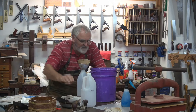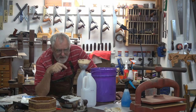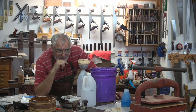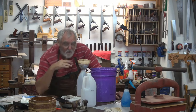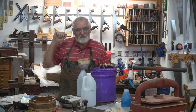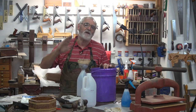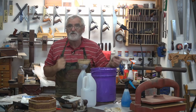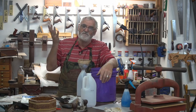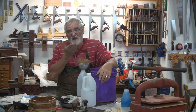Yeah, look, that's the idea. Who asked me about the debarker? Yeah, you have to be reasonably careful sanding it back. What I would suggest, and I do this on jobs, in fact, we'll do it on the picture frame tomorrow, is wet timber down maybe up to 6 times. Really give it a good larrup of water and then sand the grain off, do it again, sand the grain off, do it again. Eventually you'll wet it and there won't be any grain rising at all. There shouldn't be too much grain rising on that picture frame, because that was done with a hand plane. When you hand plane, you get very little grain raise. The main reason you get grain rising when it's wet is because you've used a sander and abraded the surface. You haven't sheared it off.